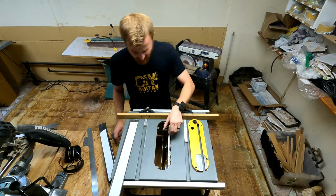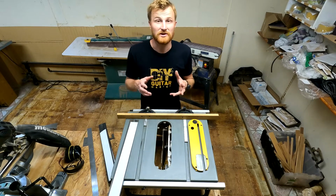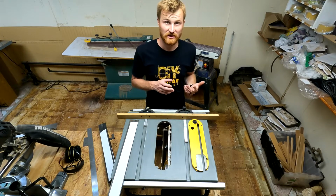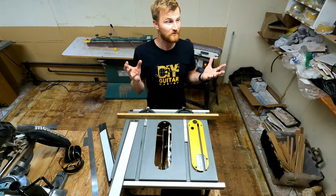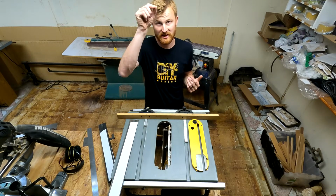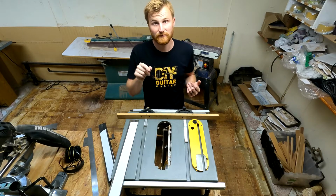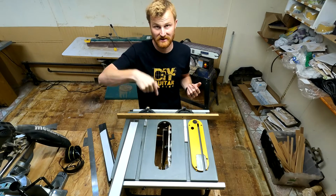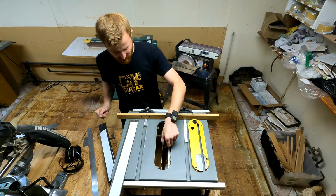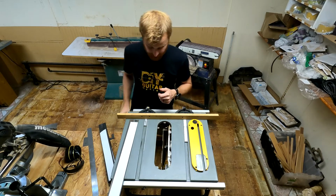They both sell it. And what it is is a table saw blade with a 23/1000ths of an inch kerf. 23/1000ths of an inch is just your most common dimension for the tang of the fret wire. The tang is that little bottom end of the T shape. It's the portion of the fret wire that goes into the fretboard. So if our fret slots match the tang, we've got a good fit then.